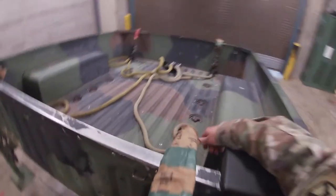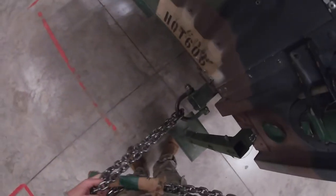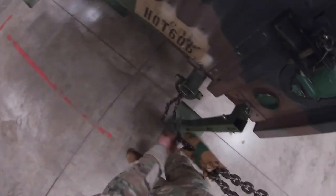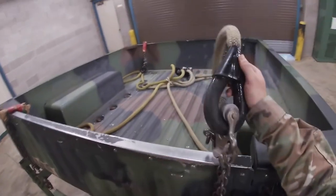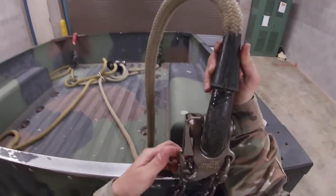You're going to get to your second sling leg in the back. Check your chain — make sure it's going through that lift point one time and one time only. Make sure you have some kind of padding. Again, link count is going to be 3: so 1, 2, and 3 in that grab hook assembly.